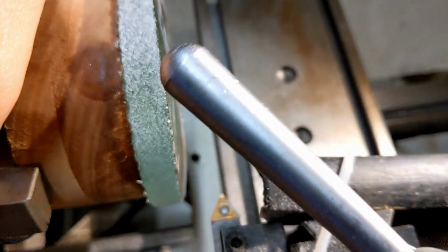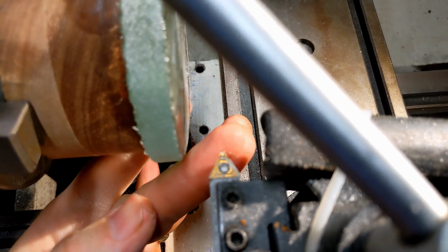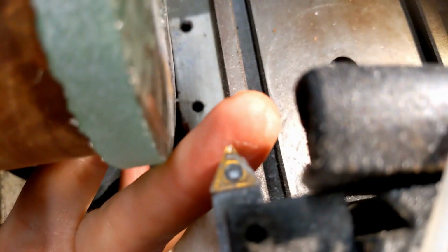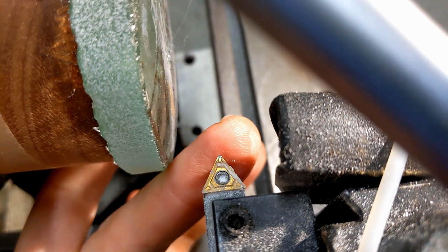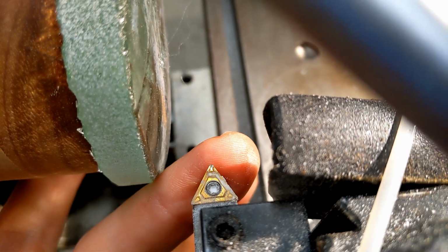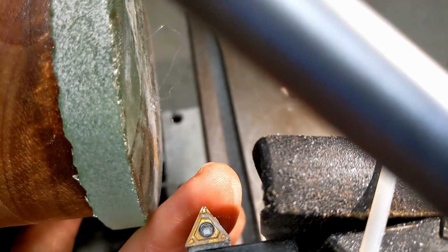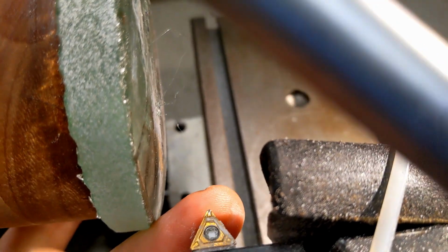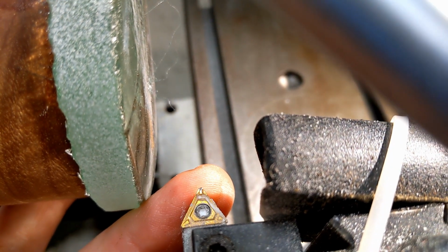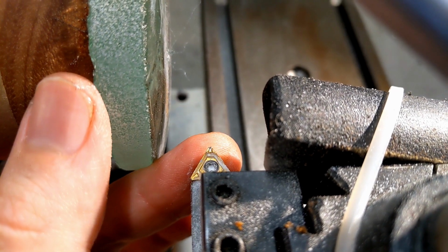My carbide is getting a bit sad. Not sure if I can get it to focus on the tip, but it has taken a bit of a crater right out of the tip. So it was still cutting all right. I didn't change anything as it was eroding, but I think long term it would probably chew through the inserts.